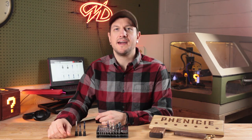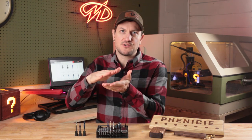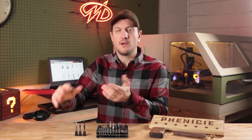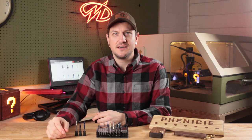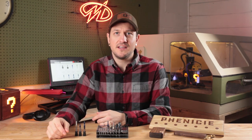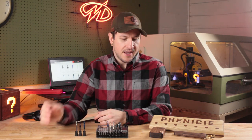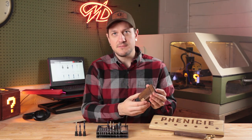A lot of times in my designs I'll be working out of three-quarter inch stock, and I'll need to remove some amount of that to get down to my actual object's height. You can use a fly cutter to level off your whole board, or you can use a surface planer, but it takes time and requires more setup. So it's great when you can clear off that material and then use that same bit in the next operation. To test that out, I made this little custom smoking box.